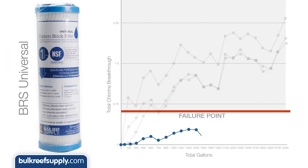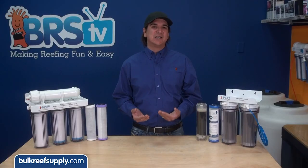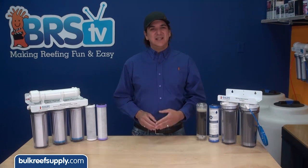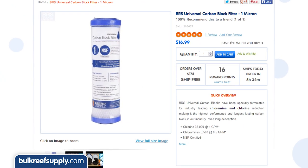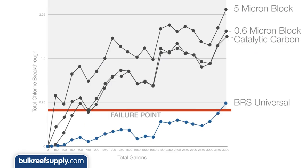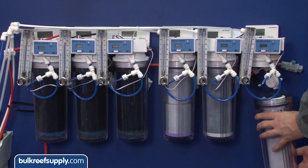I don't think anyone will be surprised that the BRS universal carbon block performed well and lasted 23 days of testing before it failed, making it far beyond 3,000 gallons. It is pretty obvious that specially treated carbon blocks like the BRS universal are the most effective solution for removing chloramines. However, they do cost more, so the real question is are they more cost effective? The BRS universal carbon block is a few bucks — about 30% more than the 0.6-micron standard block — however the results show the universal to be at least 400 to 500% more effective, which makes the decision pretty simple: you are getting 4 to 5 times the effectiveness with just a small increase in cost.